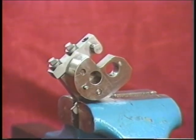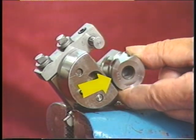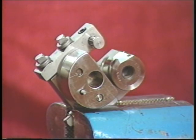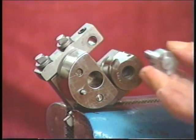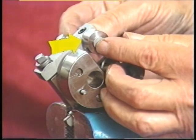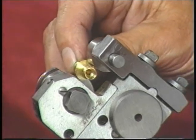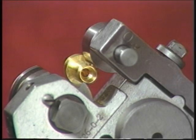The size tool itself is contained in the E2726 holder. The size tool is a circular tool, similar to a form tool. The tool is mounted in the holder and is locked down with the 7/16-14 set screw and shoe. Located across from the center line of the size tool is the size tool roll. The diameter of the workpiece being machined is controlled by the set distance between the size tool and the size tool roll. This is how the tool maintains close tolerances on the workpiece.